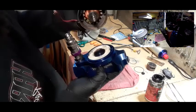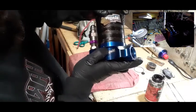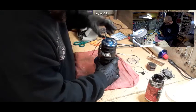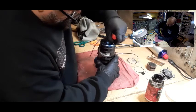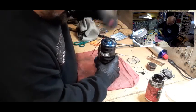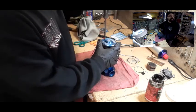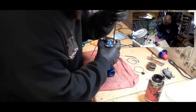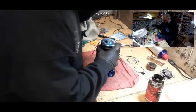Here's the pump, here's the housing, here's the motor. The bearing is already lubed up. We're going to slide it in, we pass the seal, and look at that — with a little bit of lube the thing just sat right in there. Now we've got to fish the bolts through and find where the thread is at. If you hold this nice and straight, they should fall into place. Don't tighten one bolt first — bring them both down evenly. Go back and forth between the two bolts gradually, giving each a little crank, then a tighter crank, until the motor is back on the housing.